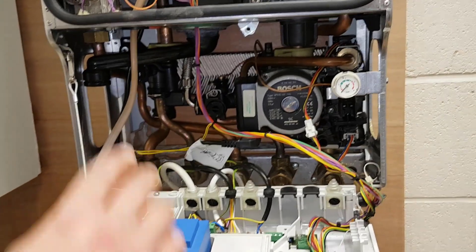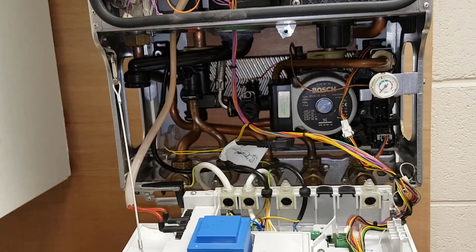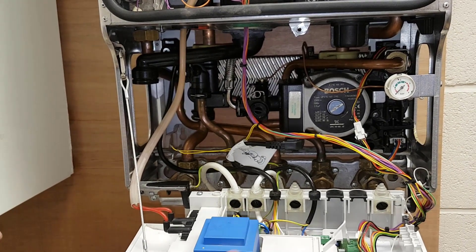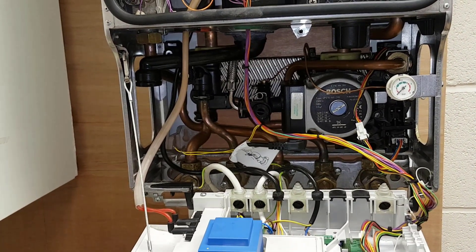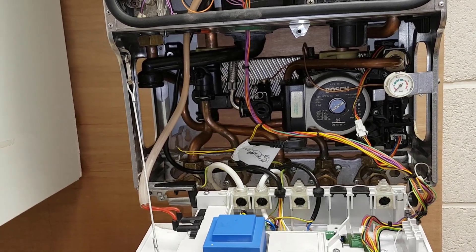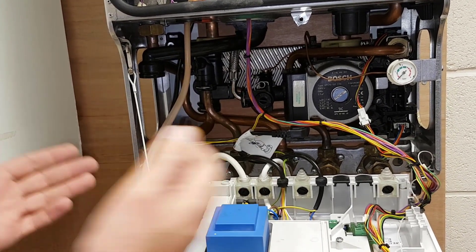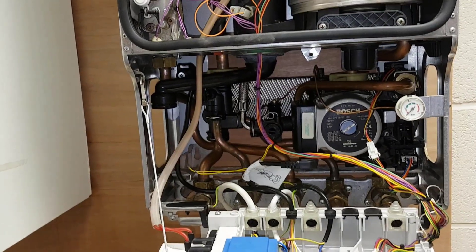So my water's safe, my gas is safe. Do we need a filling system? What would you do next? My water's safe, my gas is safe, my hot tap is closed. I'm at the boiler — I would connect my filling loop. So what's the last thing to do? Open my flow return. Correct. Then I'll be opening the flow return and make sure my boiler is at 1.3 bar. Alright, you've done that. So what are you going to do next?